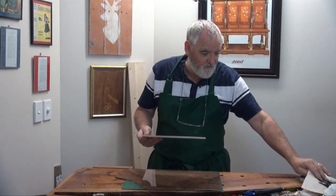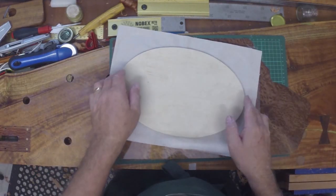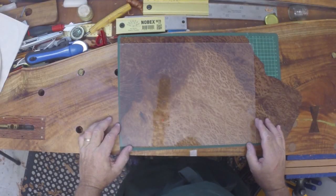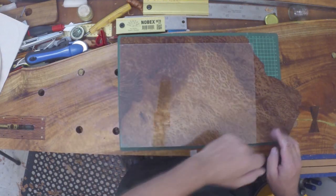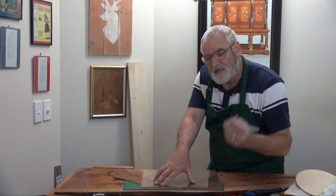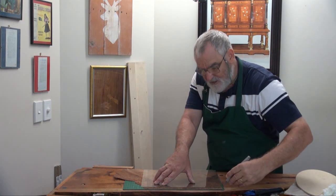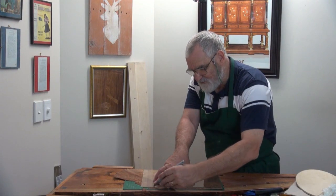Get your oval — I've worked out the oval over this embroidery and it looks really nice. I'll pop that to one side, grab my knife, and keep this as my straight edge down the bottom, then cut around the glass to give me the square. When you're cutting veneer, use only very light pressure and don't try to do it in one cut, because in a lot of cases you're going to tear the veneer. This Vavona is extremely fragile, so I don't want to force it.